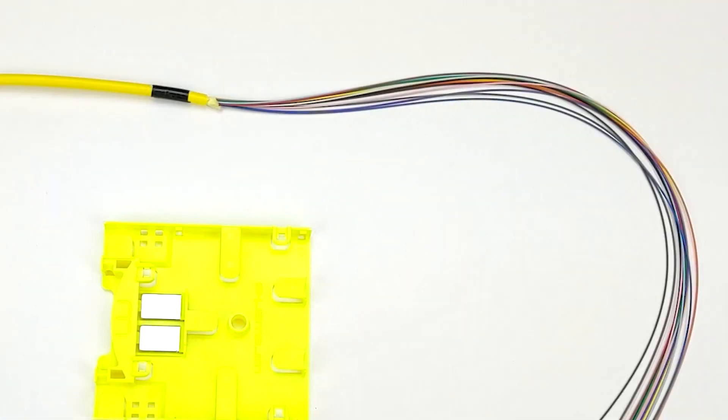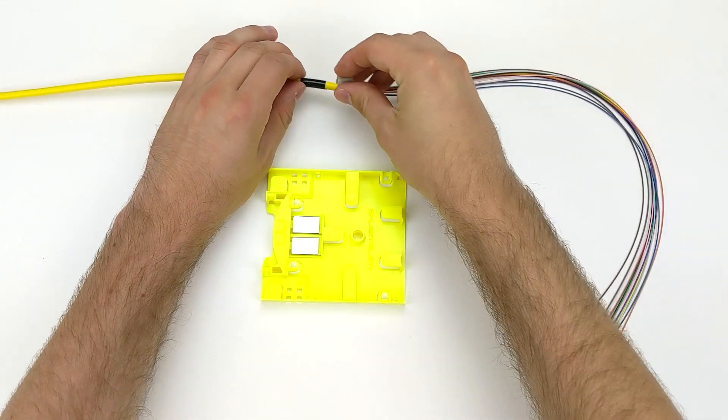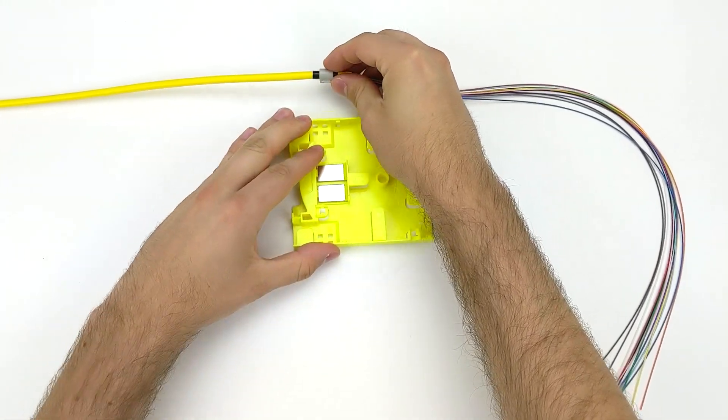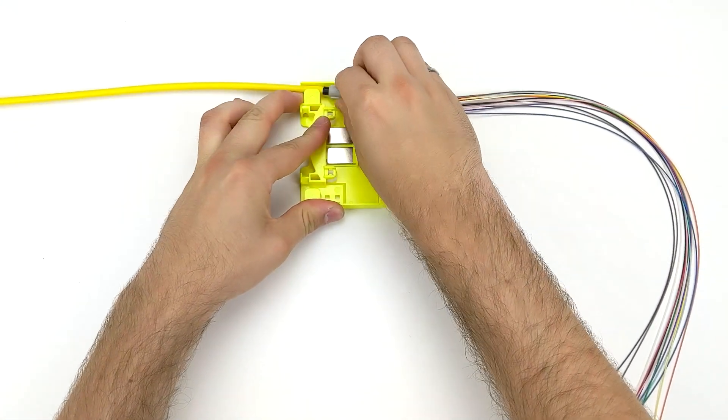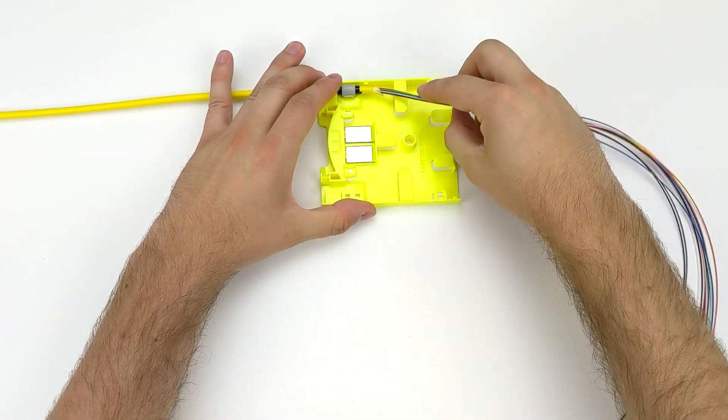For the next step, measure 18 inches from the end point of your strain relief clamp, leaving a half an inch of unstripped cable at the end point. The table found on the instructional sheet requires only to use electrical tape for this diameter of cable. Therefore, the rubber insert is not required. Place the clamp over the measured electrical tape marking and secure the clamp in place.